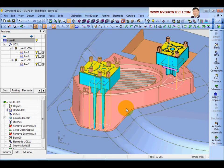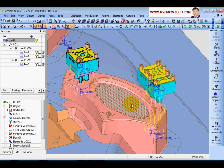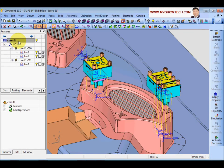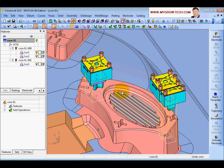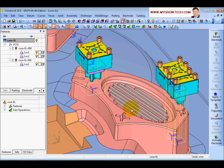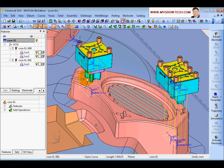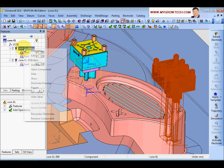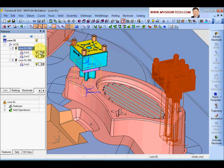For this demo I've created only three electrodes. Let's assume you created maybe 10 or 50 electrodes. The next thing you need to do after creating the electrodes is EDM setup. Right-click the electrode and choose 'EDM setup'. In EDM setup, you can choose what kind of machine you want to set up. The output can be CNC EDM code or a CNC EDM program for the machine to run.